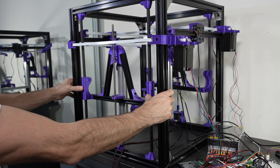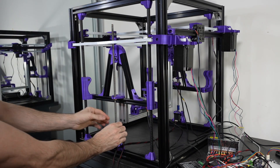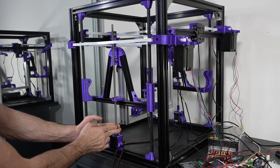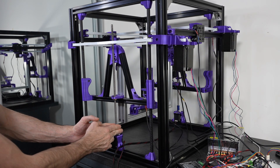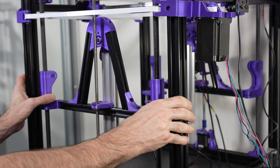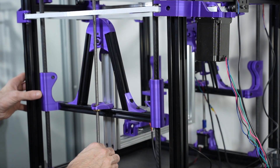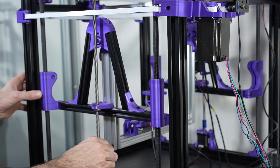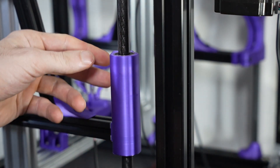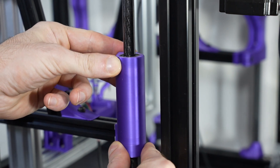Many people have previously commented that using those carbon rods is a mistake, and they are totally right. Those rods are flexible, which is a trait not ideal for this scenario — look at the severe wobble of my rods, it's absolutely terrible. The carbon rods tend to bend, and that will cause the entire printed part to mimic that wobble. If the rods were rigid, at least they could resist the force of the wobble produced by the lead screw and mitigate the issue. I suggest checking out the work done by another creator on this matter — I have linked his channel in the description. They also have poor tolerances, resulting in bearings being either too loose or too tight, making them just not ideal for this type of application.